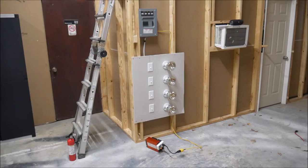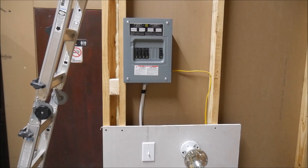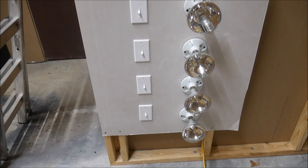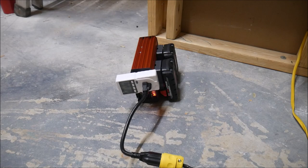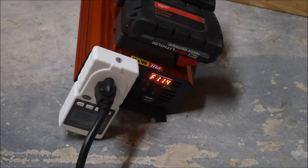All of that is well and good, but let's put it to the test. Here's my inverter and power station test rig that I'll use to put a load on the inverter. By using different light bulbs in the four light sockets, I can test almost any watt rating. For this test I'll be using two 250 watt heat lamps and one 100 watt incandescent light bulb. I also have a power meter connected to the AC receptacle on the inverter to tell me how much current is being used and at what frequency.